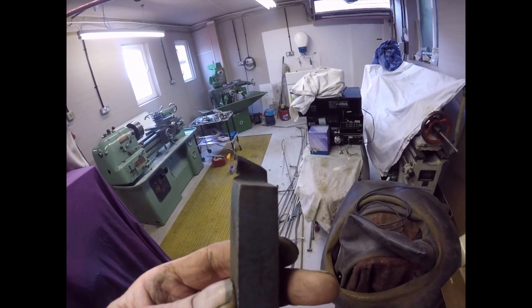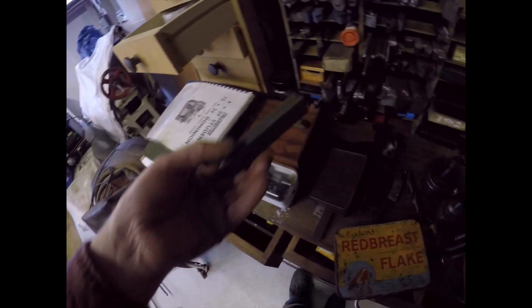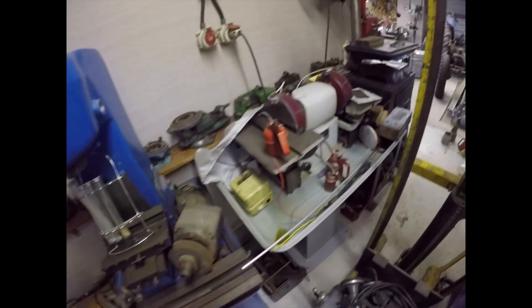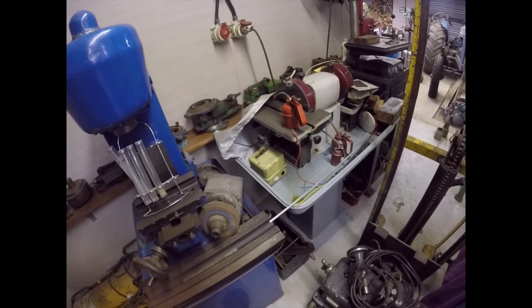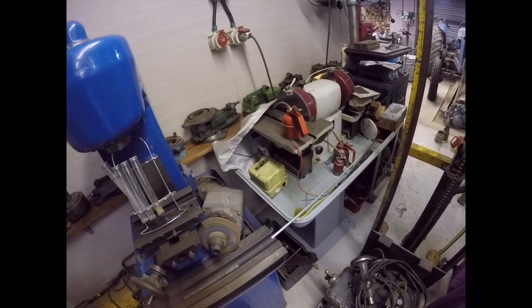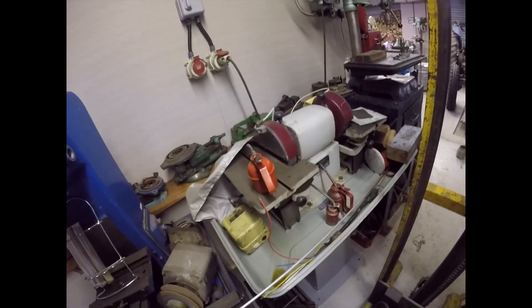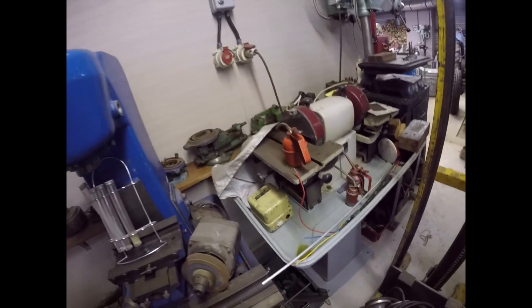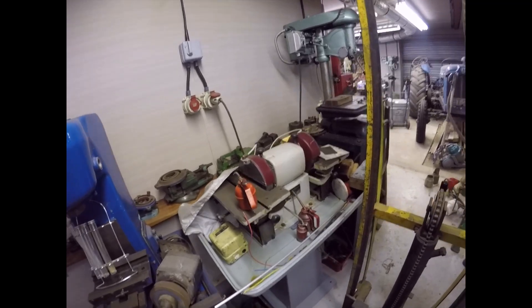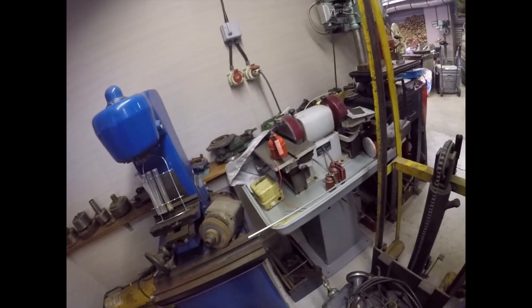That's a 55-degree thread cutting tool with a tiny tungsten carbide tip - it makes brilliant 55-degree threads. I can do BSF with it, it's fine. But it's 55 degrees and UNC is 60 degrees. To grind a proper 60-degree point, I need to get my grinder going - it's all finished and rebuilt, it just wants the electrics wiring on it. It's got angle plates and T-slots so I can clamp a piece at a set angle and get a reasonable go at grinding.